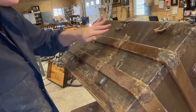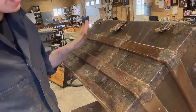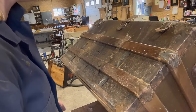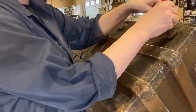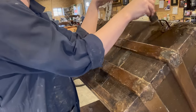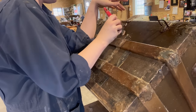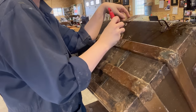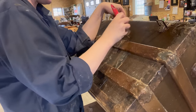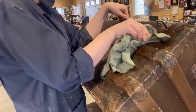Okay, so I have been grinding away on all these beautiful steel hardware pieces, as well as all the banding and stuff, and done some repairs that I'll show you, and kind of repurposed the metal and done some cleaning. So I'm using alcohol to clean up the shellacked paper burlap areas. And it gives life back to the original color. It does have some staining that won't come out, and we might do some touch-ups on the very noticeable ones, but other than that, it looks pretty good. It just softens up nicely and re-amalgamates the shellac. Then I just wipe off.